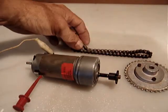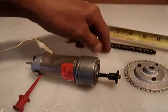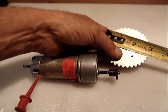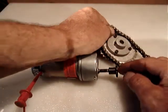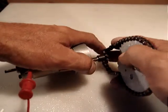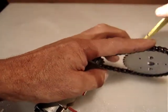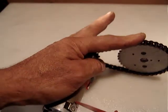You are able to make it smaller. If I straighten this and the pulley — the large pulley, which is about 3 inches in diameter, 2.78 to 3 inches in diameter — this and the other small pulley in the gear head motor. If I straighten this and try to measure between centers, on average I have about 3 inches, 3 inches away, because of the large pulley and a small pulley.